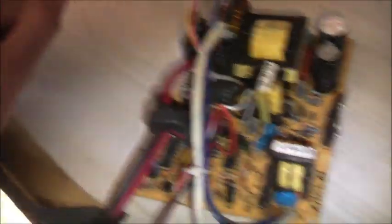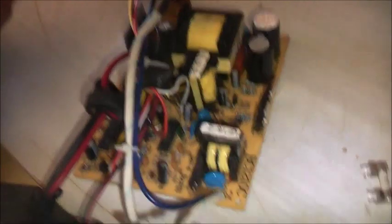Let's get everything ready and commence repairing this charger. I'm going to use my jiggery-pokery ballast — lightbulb in series — to test this, so that way nothing goes bang. That way it helps me with troubleshooting this and getting it up and running again.